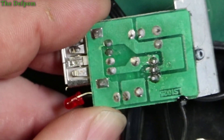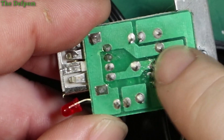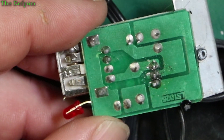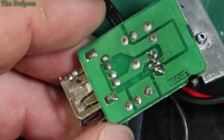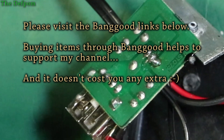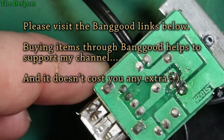I've already determined that before I pulled it apart - I measured the data lines to make sure there was actually something there. And there's different configurations for these data lines for how they work, and different manufacturers do different methods and it's all very messy. One suggestion I've seen is to put between 15 and 24 kilo-ohm resistors down to ground from those data lines, which will give you a charging current of about half an amp or so.